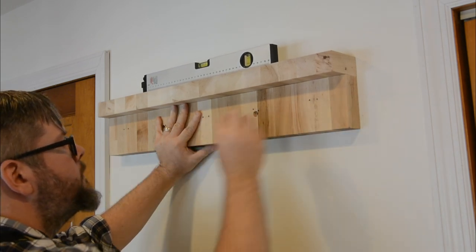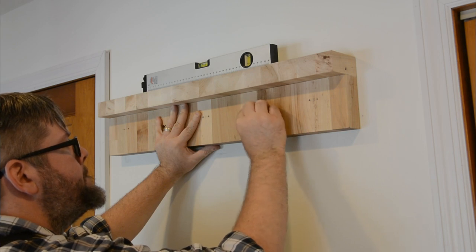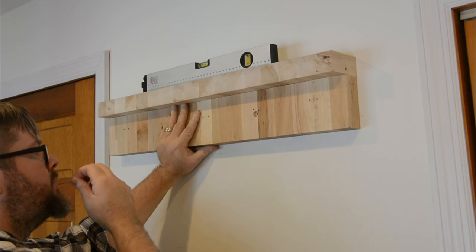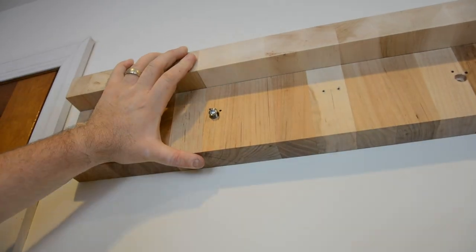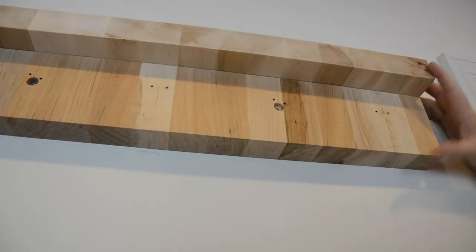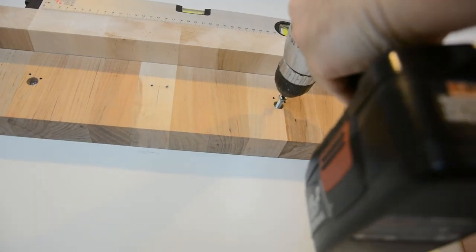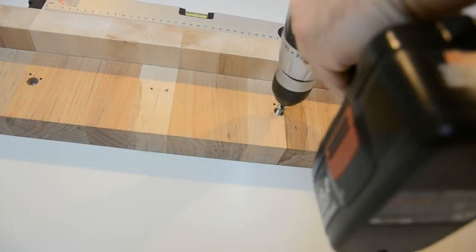I made sure that the piece was centered and exactly where I want it, and of course level. Then I shoved the nail through the holes that I had drilled for the bolts, marking exactly where I would need to put the toggle bolts into the drywall. At this point, you simply go through the process I showed you of how to install the toggle bolts, making sure they're exactly where you made your marks, and then it's just a matter of getting your bolts and your piece and putting it up.